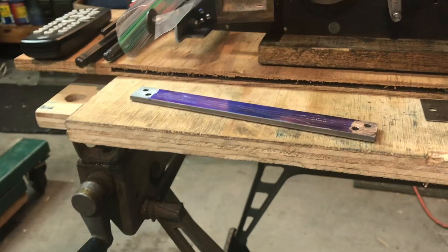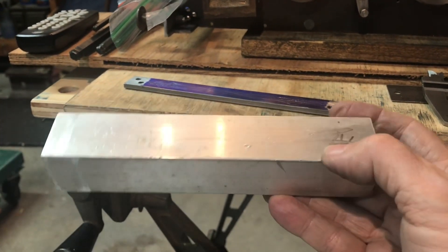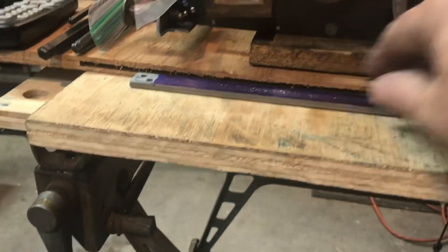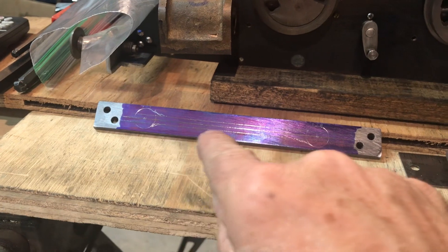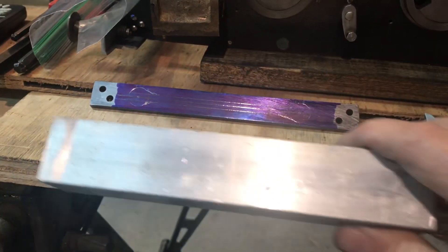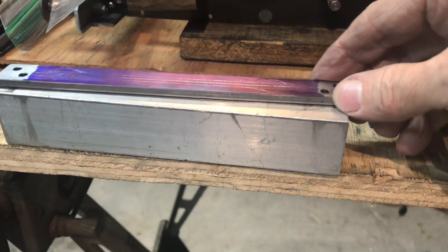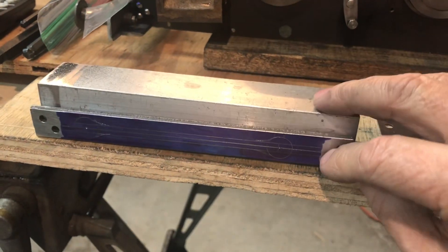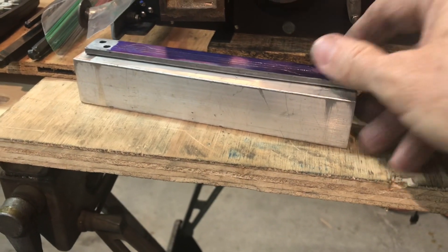I'm not going to do everything exactly like he did, but definitely similar — my idea is a little more simple. I've got some inch-and-a-quarter aluminum block, it's actually a square tube. My thought is to drill and rough out the center portions with the bandsaw to remove some material and make milling easier. Then I'll take the square aluminum tube and fasten the blank down using 3/16ths inch holes with 10-24 screws and crazy glue, and then use the block in the mill to index off of it for drilling vertical holes, end milling, and thinning it out.